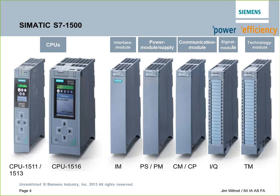DIN rail backplane. So it creates its own bus as we go. All of these modules here connect together by a little U-shaped connector that fits in behind them. And as we go along, we add more modules. We create the backplane as we go. So the actual DIN rail itself doesn't have any active components in it. The bus expands as we go.